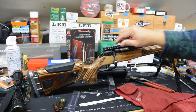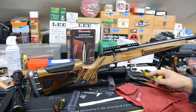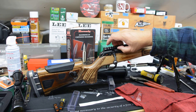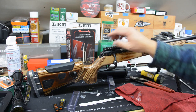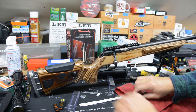That should be right on 8 inch pounds if this is accurate below that scale. I think it seems solid enough. I don't think it's going anywhere because all these screws are really acting like jack screws — since this is already in the dovetail, they're putting downward pressure which drives this rail up into the dovetail and keeps it from moving. So that should be pretty solid.